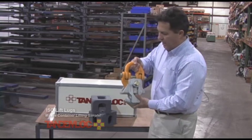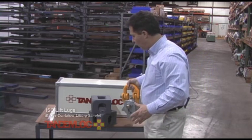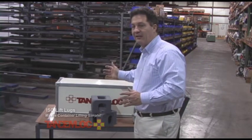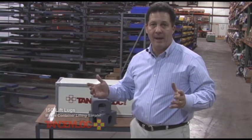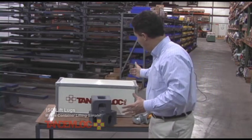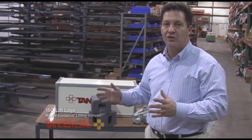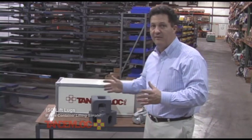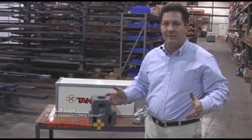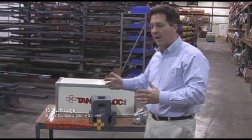The angular lift lug, or lift lug with FlexLink, is designed to lift empty containers at an angle. Its working load limit is sufficient to lift containers specially designed to handle the loads of an angular lift — sometimes those containers could weigh quite a bit. We've had applications from the military where they take advantage of the ISO envelope and ISO corner fittings, but the designer of the actual box has taken into account that they want to use a four-legged bridle sling at the top, so it's a beefier container. It is the user's responsibility to make sure that the container they're lifting is sound enough to be lifted and to know the parameters between lifting at an angle or lifting straight up from each of the four corner fittings.